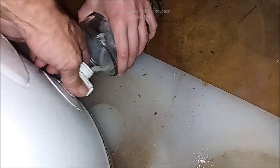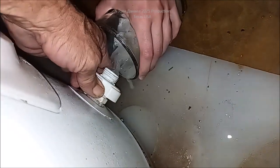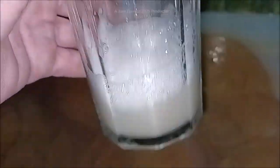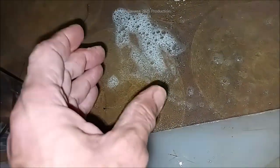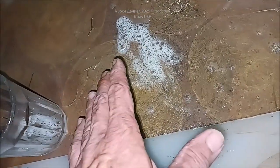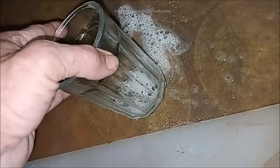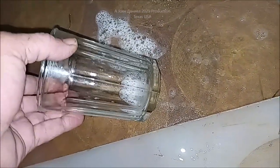Do you see that burp of crap coming out of there? Look at the chunks. So now you'll see that nice brown liquid — look at that gunk coming out of there. This is what the water heater is full of. That gets around the elements, reduces the volume inside the water heater, and creates a heat sink — it just eats up all the heat you're trying to make. Nearly 90% of people in the United States with a water heater that's two years or older are going to have this.